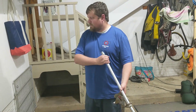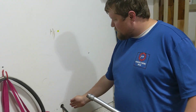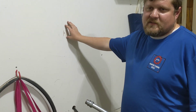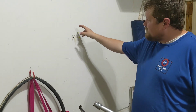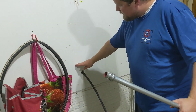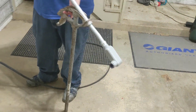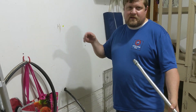We had a bit of an amateur-hour moment — we said we'd miss the stud just a little and come up and catch it, but coming up level we actually miss the stud entirely. Also, this conduit probably only reaches to right here, so we could have drilled right at the bottom. Instead, we're getting the bender out and putting a little kick on it so it comes up and lands right on the stud.